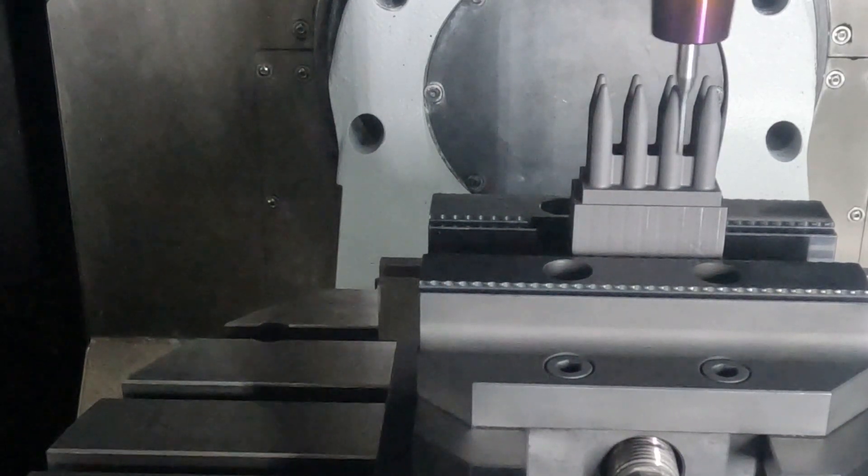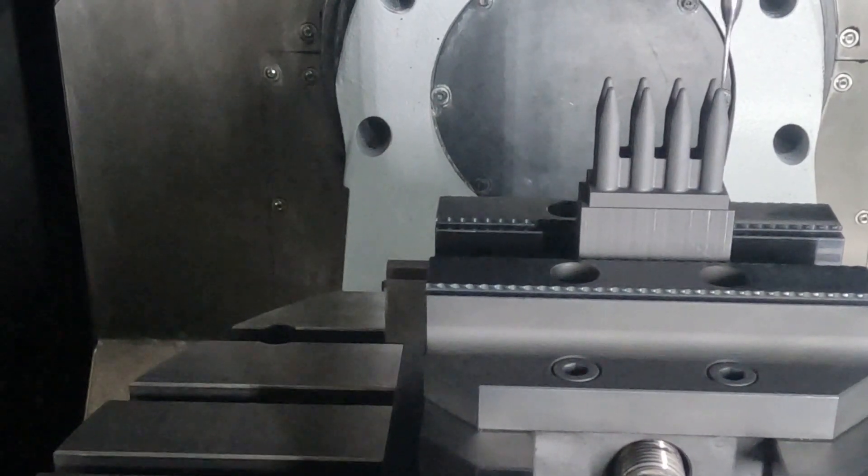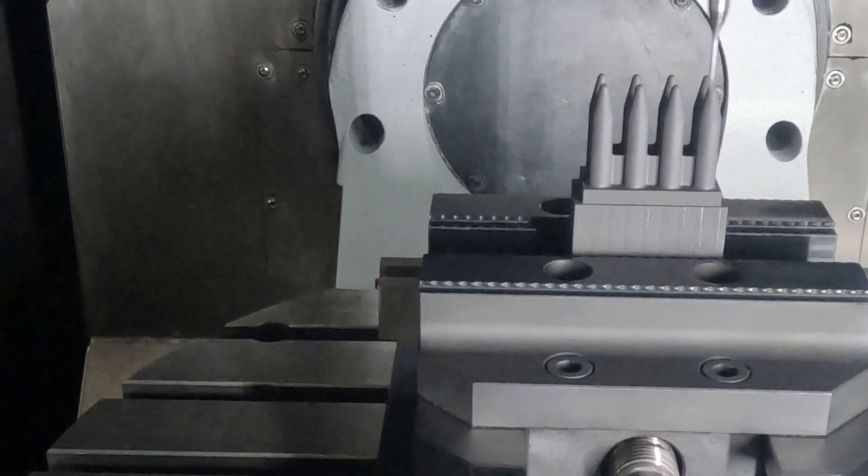You have given me so much ammo to go on here — I don't even know if I can highlight it for everyone. Linear motors, which instantly means precision and speed. You mentioned automation, the ability to go from graphite to steel without losing torque and horsepower when I need speed. You mentioned up to 50,000 RPM, and did I hear you say 0.1 micron? We have a component over here demonstrating that 0.1 micron. For the audience watching right now — do you know what a micron is? We're talking about splitting hairs to get to a micron, and Keith just told me 0.1 micron. It seems crazy, but I did see it.